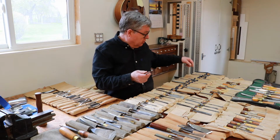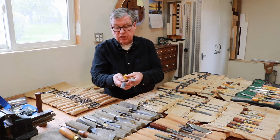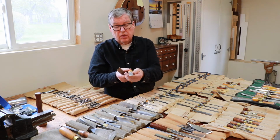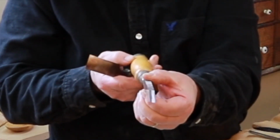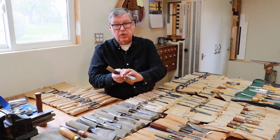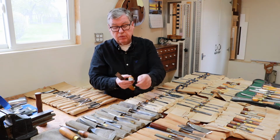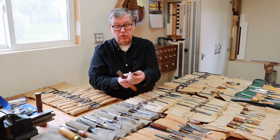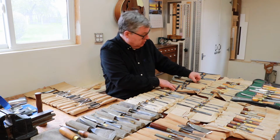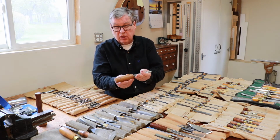And there's 2 types of chisels I have. This one is a cabinet maker's bench chisel, and they're beveled for cutting dovetails for clearance. This is not beveled. This is called a firmer chisel, with steel cap ends, so that you can really pound on them with a mallet. And this is for chopping mortises, and I sometimes use them for wood carving, depending on what I'm trying to do. It's more for joinery. Here's an example of a chisel I got at an estate sale. And I actually found an old chunk of wood that I made a handle from, so it looks kind of period.